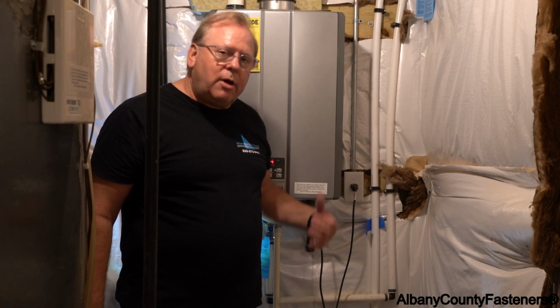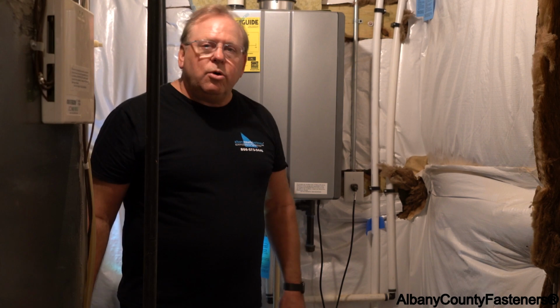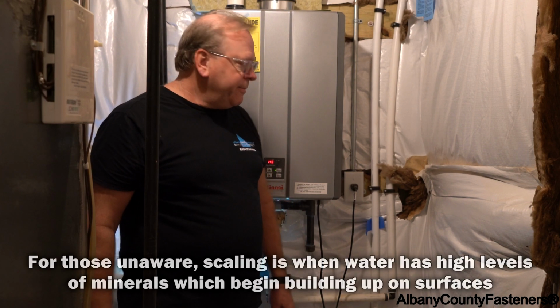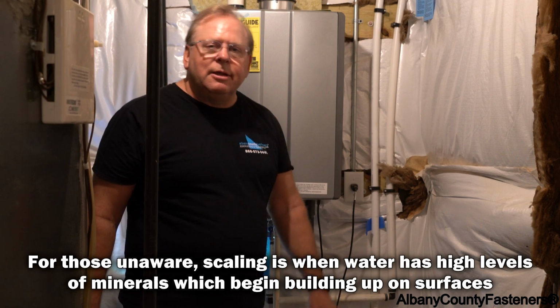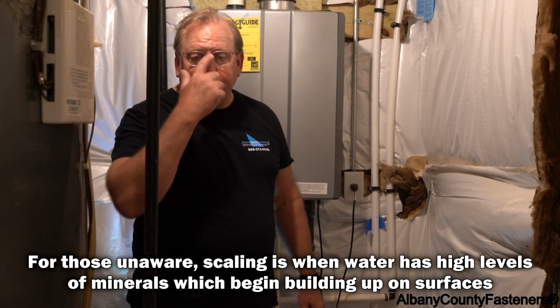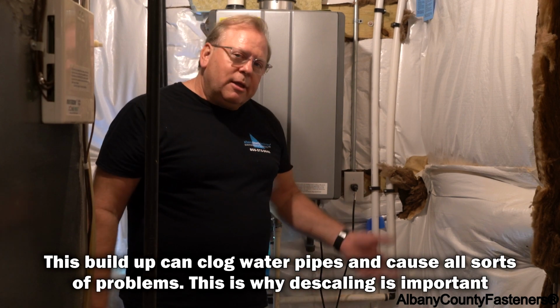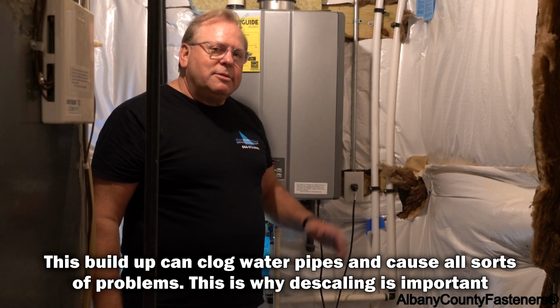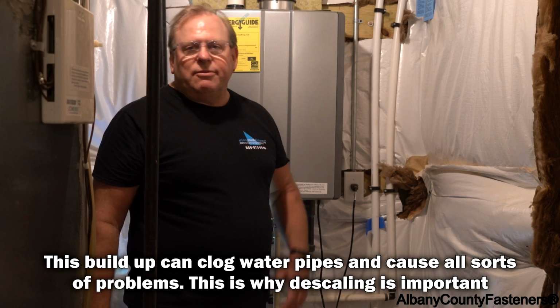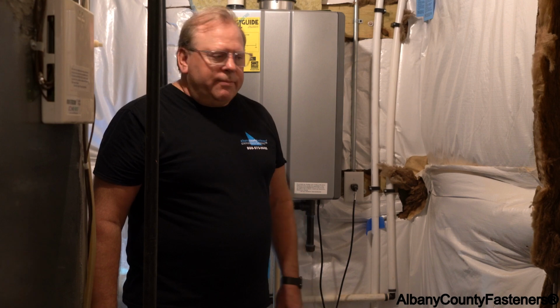Today I'm going to show you how to descale a tankless water heater. You're supposed to descale these every 12 to 18 months depending upon your usage. So if you have 2 people, you'll get by up to 18 months. If you have 4 people, you're going to want to do it every year.